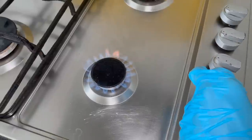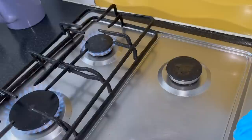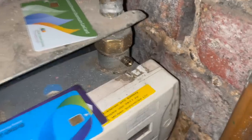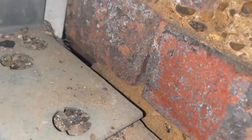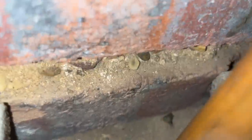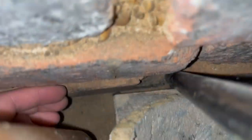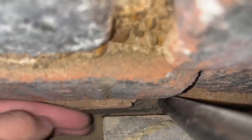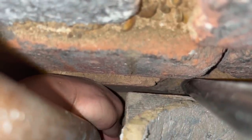Gas leak sorted. I've also sorted the injector on this burner as well. So it should be time to go home. But when I go to disconnect my U-gauge from the meter and put the test nipple back in, it doesn't really go my way. When I was tightening it I thought it was in, but it slipped out my fingers and fell down one of the holes. Luckily it landed right there, so I was able to get it out - landed in one of the best positions possible. The lesson I've learnt from this is always have spare test nipples in the van.